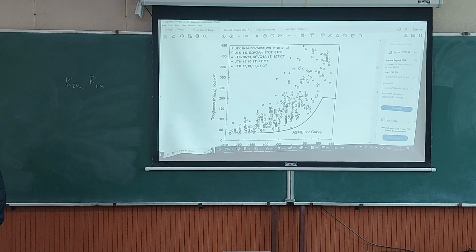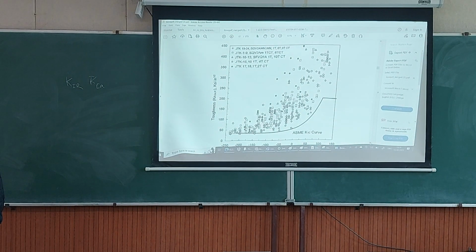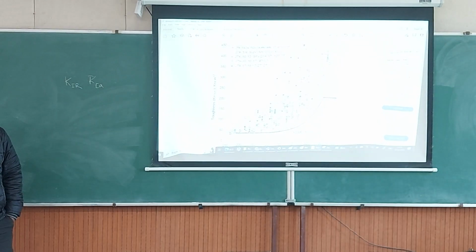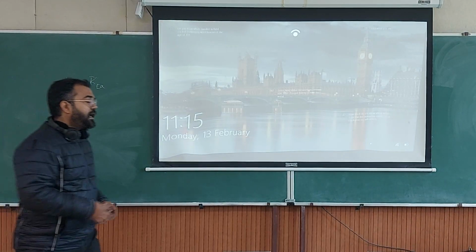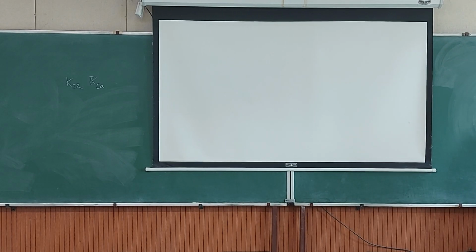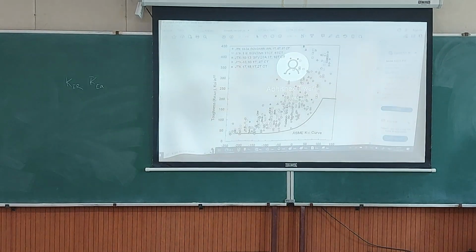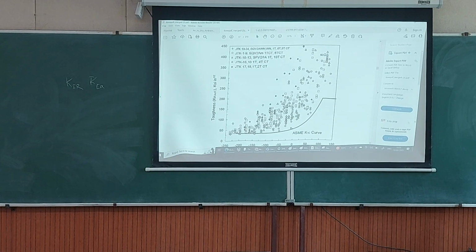And you see that the tests are done for one material. This is one material, but they have been done at different thickness. So you have 1 T, T meaning thickness, 1 T means 1 inch. Okay, so 0.5 T will be half inch, 1 inch, 2 inch. People don't go beyond 2 inch because for a steel that is already too much. So you see different symbols, circles and squares and open circles and triangles. And you see for different temperatures you have a huge scatter.